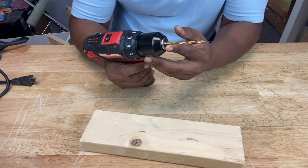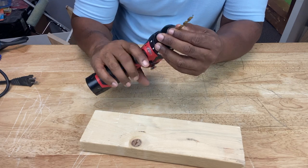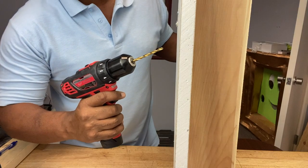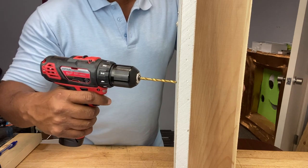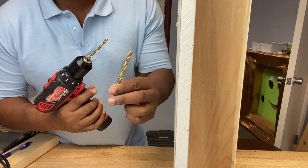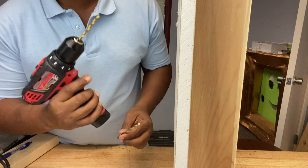All of these things can make some wood harder to penetrate than others. You as a DIY person don't necessarily have control over these factors, but you do have control over the drill bits. Are they dull and causing more resistance as you're drilling? If you suspect a dull drill bit — for example, if you can drill through the drywall but you're having a hard time penetrating the stud behind it — test another drill bit. If that one has no problem, the first one was most likely dull.